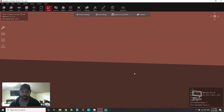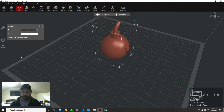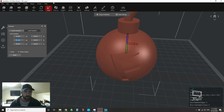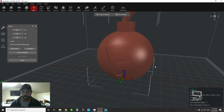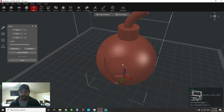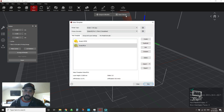Now let's switch to a spherical model — this is my trusty f-bomb. I normally print this at 150% and sink it into the bed by about five millimeters so I have something flat to print on. What I like to do is put the z-seam right on the back. I want a clean wall all the way around, and if I've got a little zipper running up the back it's totally fine — it almost makes it look like a two-piece molded part, which is kind of cool.